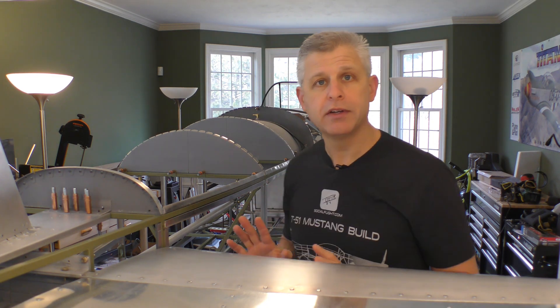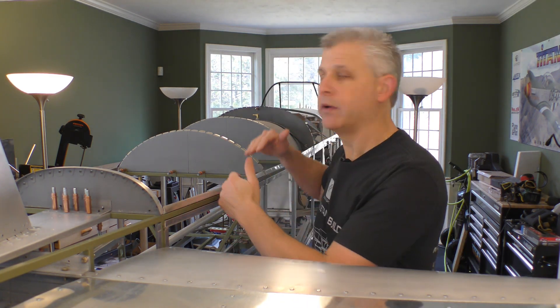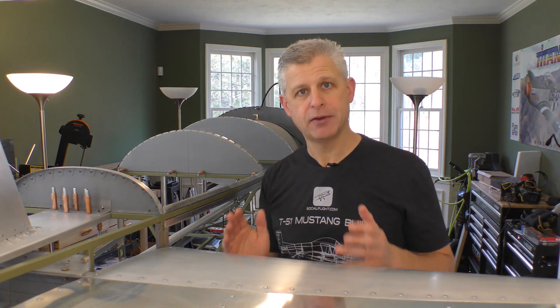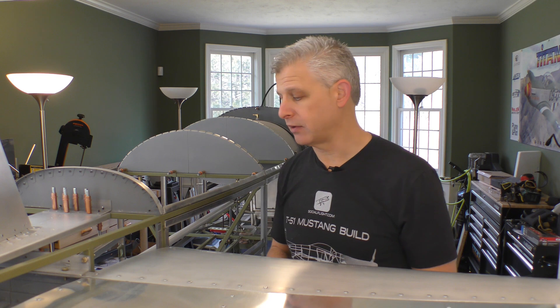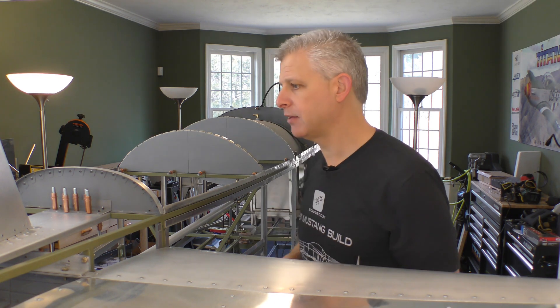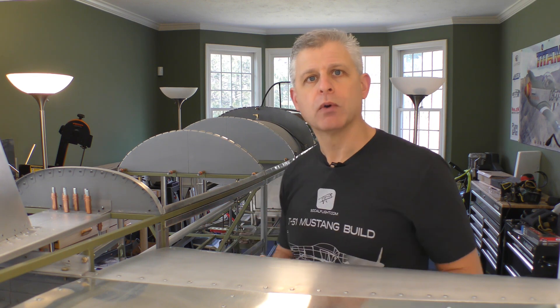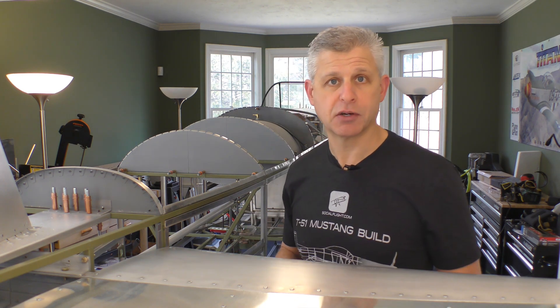What we're going to do is take a sheet of aluminum and stretch it across the top of this. Now there's a compound curve here — the curve going across as well as the tapering that happens as the fuselage gets more narrow towards the tail. The way we work with that in the T51D Mustang is we stretch this across, punch holes in the bottom of the skin, and actually stretch it down over these with bungee cords.